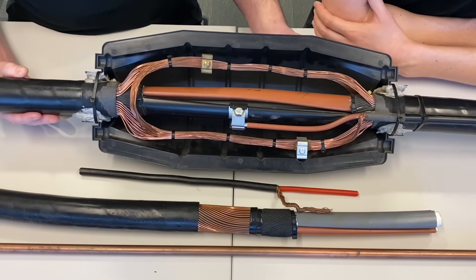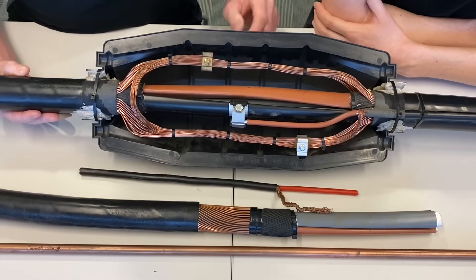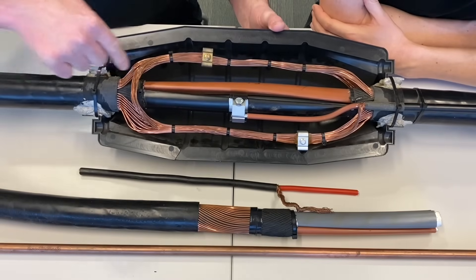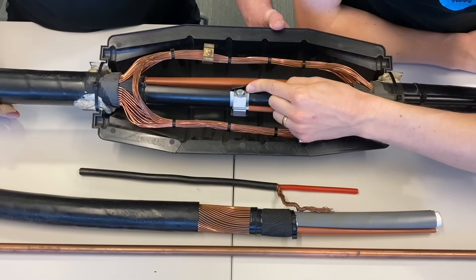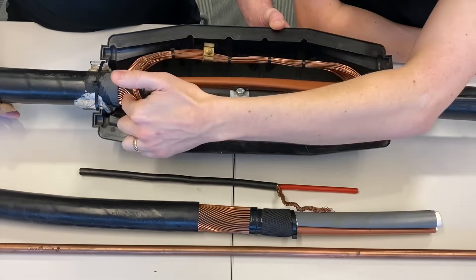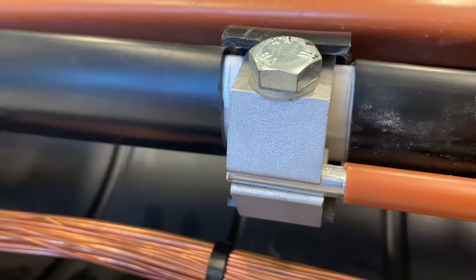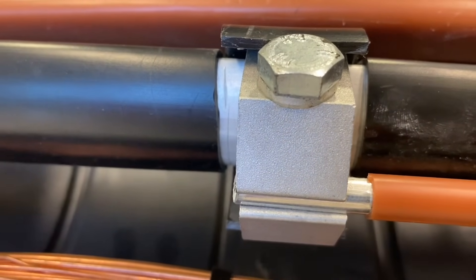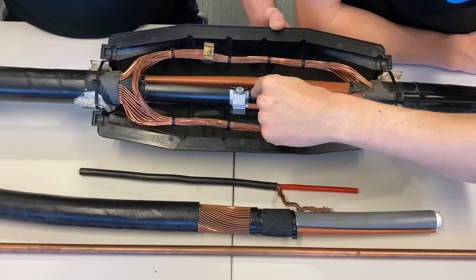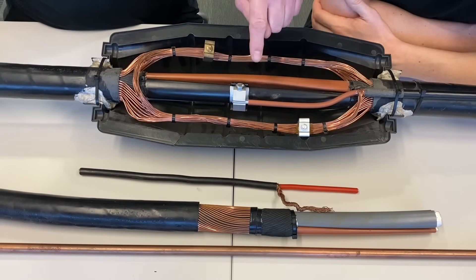The big issue is if we lose this conductor, we don't just lose our neutral — we also lose the protective conductor for the installation. Obviously neutral current could find its way home through metallic water pipe or gas pipe, and there are big issues around broken pens. We reiterate this in the classroom. Inside the joint, you can see that the conductors have not been cut through at all. All that's happened is they've separated the conductors, carefully removed insulation, peeled back the copper armour to expose the aluminium conductors, and cut away a tiny bit of insulation. It's a really neat job.